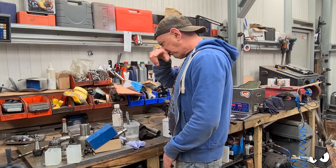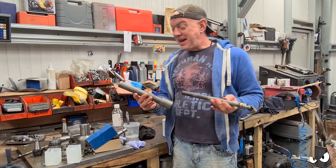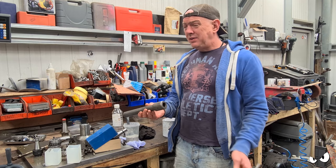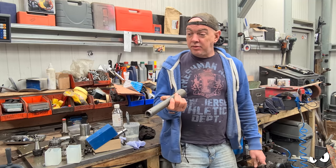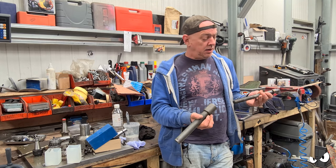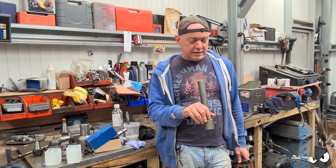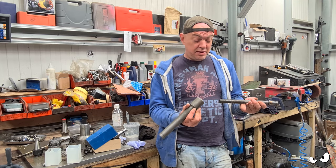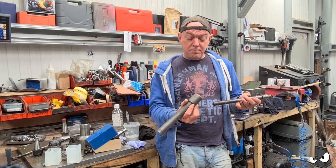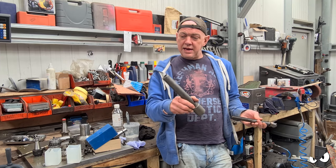Today is now Wednesday. So I've got a couple of hours in here and then I've got to go to new work. But yesterday we had a little bit of success. Look at that. This is the prop shaft. I mean, everything has happened to this. It was rusty. So it's gone through the de-rusting tank with that DOXC stuff. More of that in a minute. It's had WD-40 down the end of it. It's had petrol down the end of it. It's had oil down the end of it. It's had everything down the end of it. And it still weren't shifting. I've heated the bugger up a couple of times. That didn't work. So anyway, I've had it sitting in a bucket with like a 50-50 mix of petrol and diesel. You know, just so I can lay it down and it can all get in there and stuff.